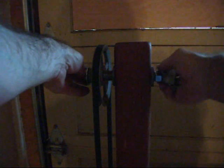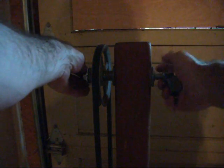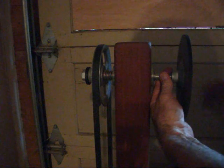The reason I'm using five-eighths inch bolts is because five-eighths is actually the same size as most grinding discs and sanding discs you get at the hardware store. So I can take out that bolt and mount a sanding disc — like you have on the end of a power tool — in there as well. I jam it tight against that pipe with a jam nut, and when the pulley spins the sanding disc spins. I have an adjustable table I can put out here for different sanding angles and operations.